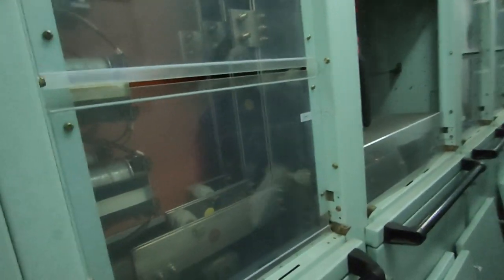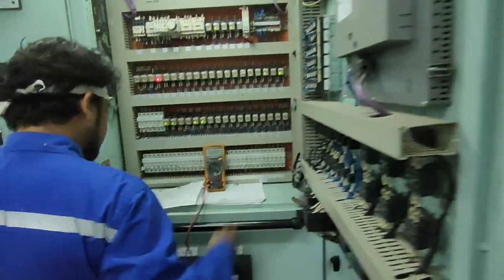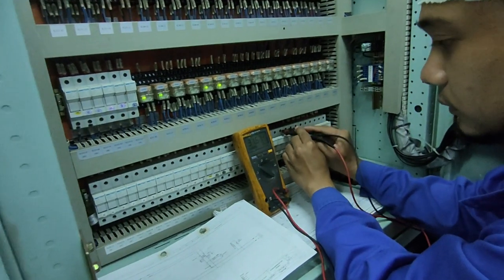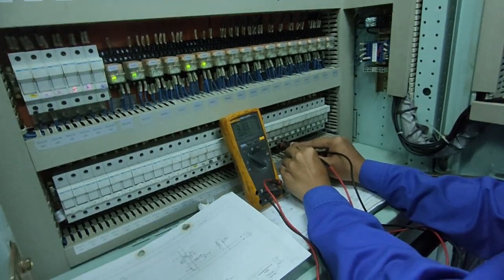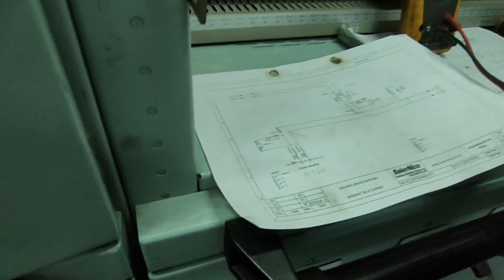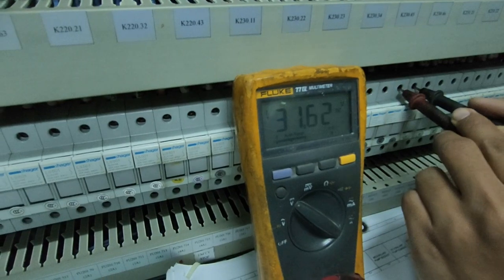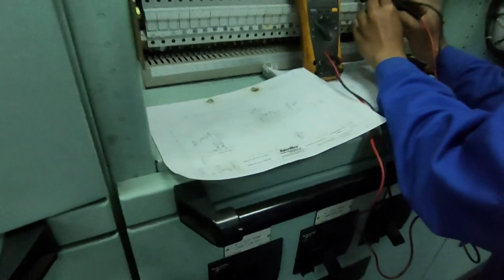We will check another thing. We will check the alarm on our PPU — protection and paralleling unit. So that is 31 volts. Why? It's supposed to be only 24 volts, but we're reading 31.62 volts. From the other side, the source is 30 volts — it's a live source.